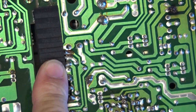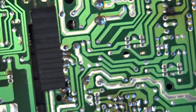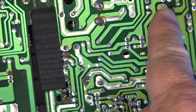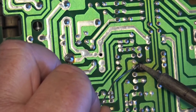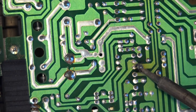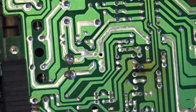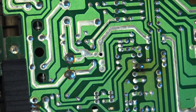this is supposed to keep the base from getting too close, but as you can see, it's become compressed over the years. You can see the grooves in here, and those would be from the slots here, right? So this is supposed to keep the board compressed, but that was long enough that it was actually sticking out and touch it, made contact. But I'm going to redo that connection. It's all burned black there. So we'll start with that one. These other ones over here, just looking at them closely there, those are just scratches, they're not cracks.